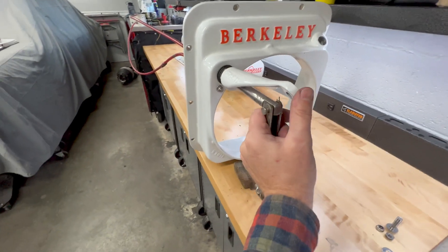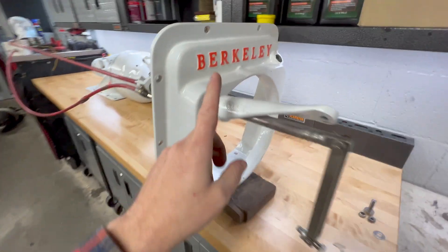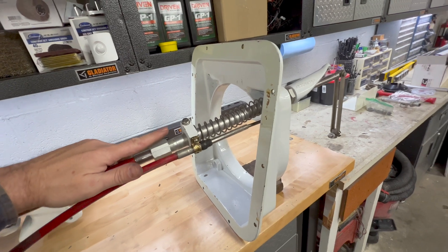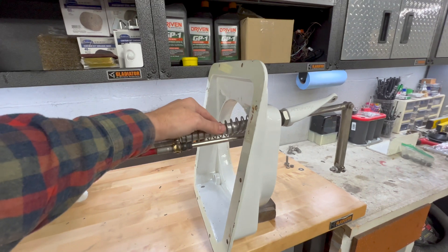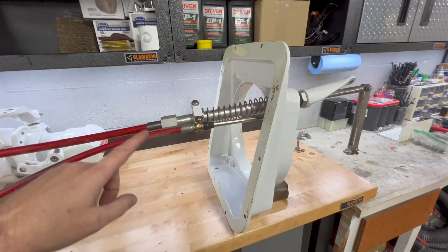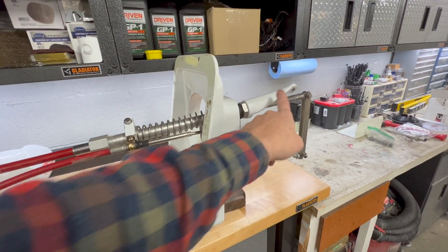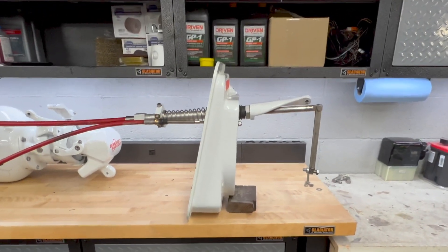The steering control is completely separate — I can move that in and out independently. In order to operate the jetovator control, by running that electric motor it's going to pull this cable in, which takes the steering cable and pushes it through the plastic adapter in the transom. The spring is there to help return that cable. This is your adjustment for this setup — we're basically leveraging the transom to pull the steering cable in and out, which will adjust our jetovator.